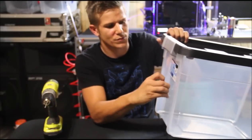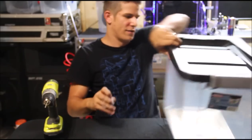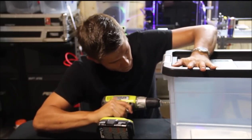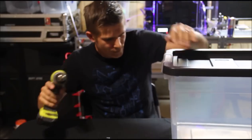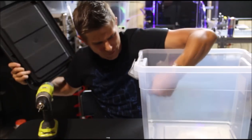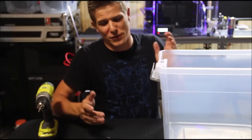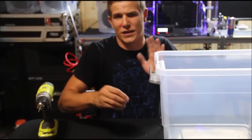Let's just test that and make sure the screw's going to go in there. Right in. Do the same for the other side. On the inside you might get some little burrs from drilling — just go ahead and knock those off. You're going to want your pieces to lay nice and flat against the side wall of this box. If they don't, it ruins the whole point — you want a nice tight seal to avoid getting any moisture in there.